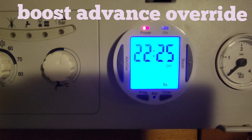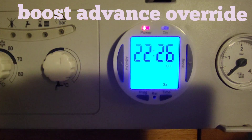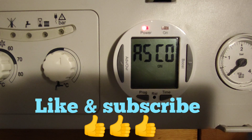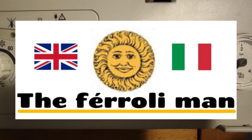If you've completely messed it up and can't remember what was going on, restart the video. Get a paper clip or a pen so you can press the reset button — press it in and let go and it'll start fresh. Then go all the way through from the beginning of the video again. That's how you set up the new time clock on a Ferroli boiler.